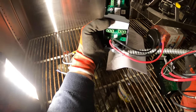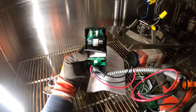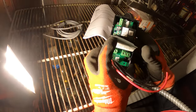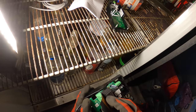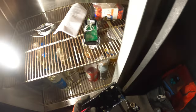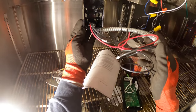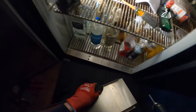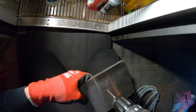I believe I could put the screws in on this one without taking out the board. Let's mark it over there and drill some screws in. Just to be a little safe, I took off the one screw on the bottom left here. And then you can kind of just pull this out. I feel like it will be a lot safer. Put that on some cardboard. I can mark the holes and everything and just put it together. Definitely don't want to make any holes in the refrigerant lines or that drain hose. So let's drill some holes here and get this started.